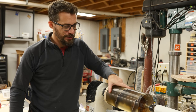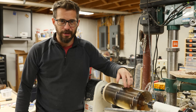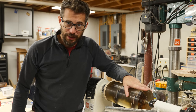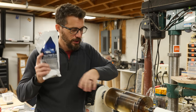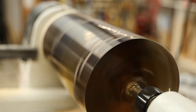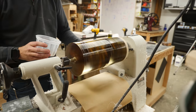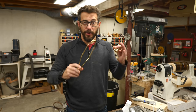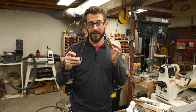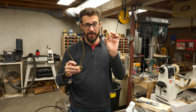After a whole lot of turning, I finally got this thing down to basically a cylinder. I had to turn off a lot more than I expected because there was a big chip in the middle and I had to get down past that, so it's a little bit smaller on the outside than I wanted, but it's in pretty good shape. Now it's really cloudy, so we're going to cover it with a couple coats of gloss varnish - we're just going to paint this on the outside while it's turning really slowly so there are no drips. While I'm waiting on the varnish to dry, I'm going to move on to these pieces. I don't really like this shiny brass gold thing, so we're going to go ahead and spray paint these with a matte black. It's going to be covered up by a shade so you won't really see it anyway, but it will cover up this color.